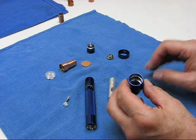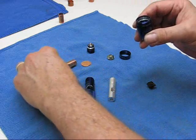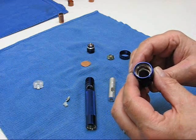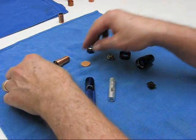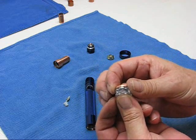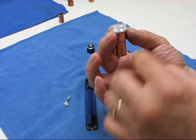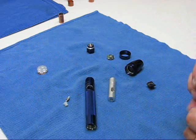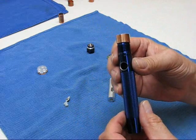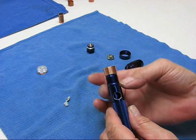I did the normal thing with the head — a little bit of mill work on the drill press to fit in the triple and also to fit in a copper insert which would hold the driver in there behind. So I'm going to have my star and TIR optic and some copper discs, and then that will set on top of a hollow copper pill that will go down inside the body. I decided I ought to do something to help spread the heat a little bit, so this copper insert will go right up and touch against the top of the body and be up inside the head. That way it will bring some heat down into the body.